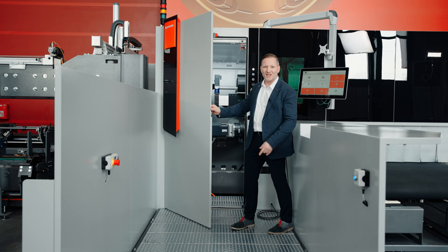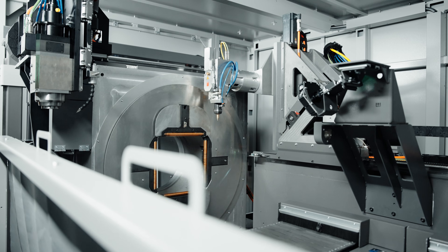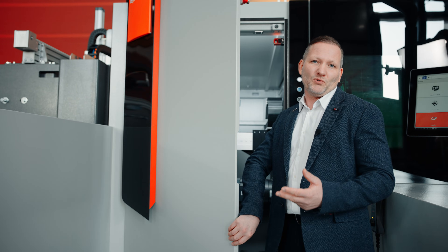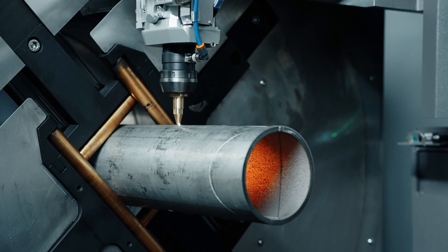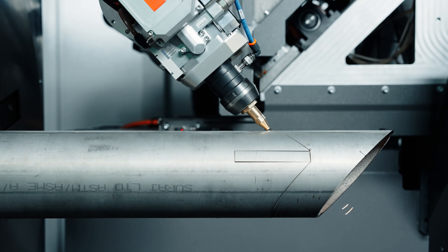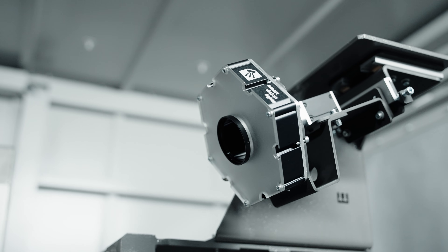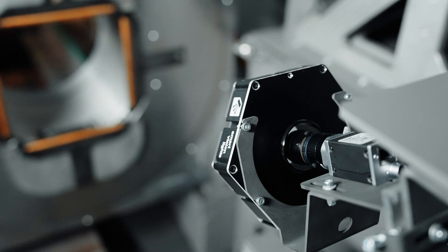The Bi-Tubestar 330 comes with power options of 6 or 10 kilowatt. It works fully automatically, integrating even further processes like drilling, tapping, marking, and face cutting without any manual intervention. That's right. And with all these features, you get the highest quality cuts every single time. We ensure precise measurements with the laser scan, while the weld seam camera detects the weld seams for optimal cutting. We enhance cutting speed and quality with quick cut.